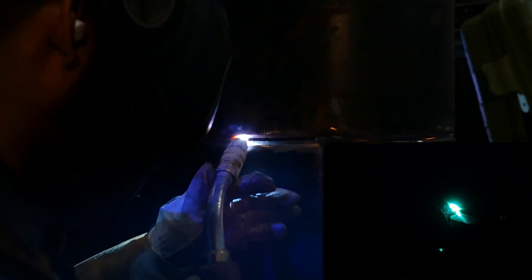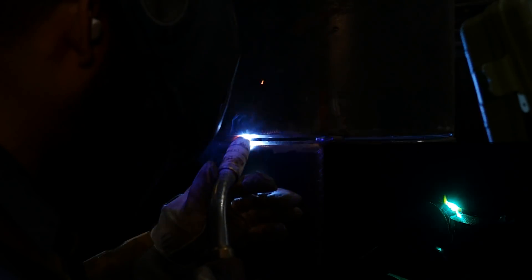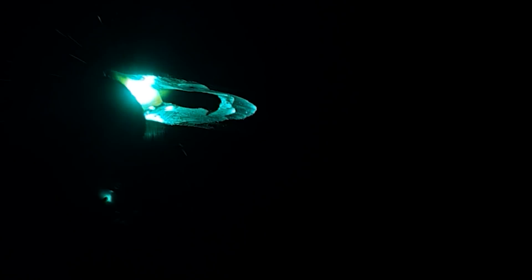I'm rooting this on short circuit arc around 130 amps. I'm trying to aim for the front of the molten pool — that way I'm always moving forward without building up too much metal deposit on the inside. If you aim towards the back you get too much heat in the root and it wants to blow through. I'm keeping the gun tilted so the tip is pointing upwards, to help fight gravity pulling the molten pool down and stop it from dripping. With big gaps like this you're constantly fighting the molten pool getting too hot, which is why I'm moving the torch so much up and down.